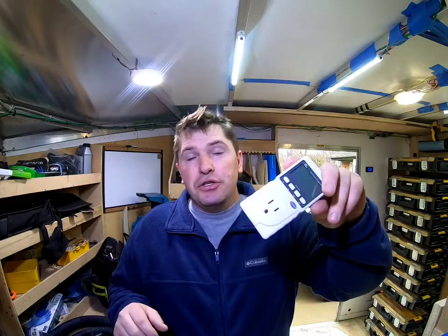So let's take a look — this is the PN2000. I don't have a link yet, but there will be one in the description. It's about 30 bucks give or take. Just so you know, the usage for this monitor is less than one watt and it's 16 amp max, so you're not going to put this on a 20 amp circuit.